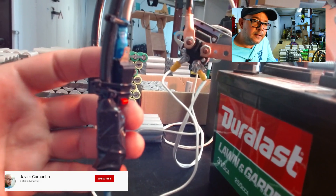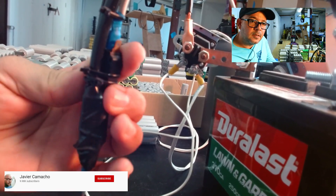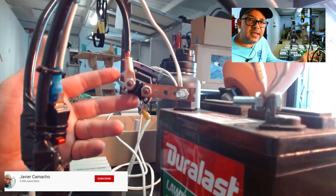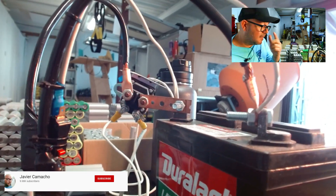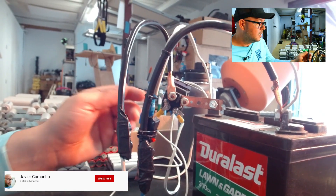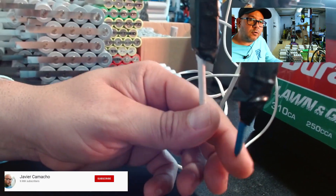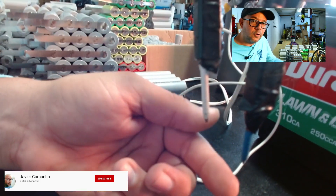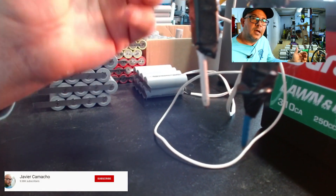You can hear that — that's the solenoid being activated every time I hit the switch. That's basically it. The way this thing works is you activate the solenoid using a relay, the full circuit gets completed, and over here where you have your battery, the whole current — 250 up to 310 amps — goes through the battery, through the nickel, and makes the weld connection.